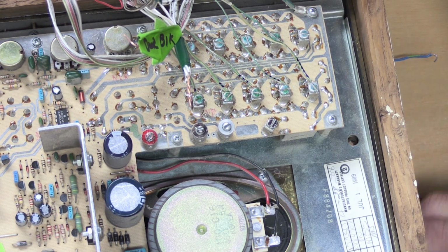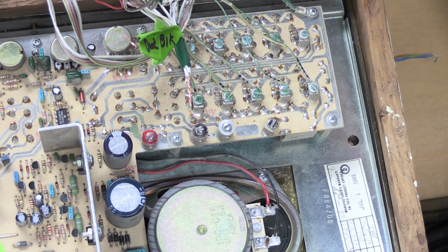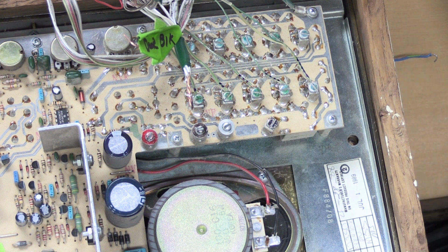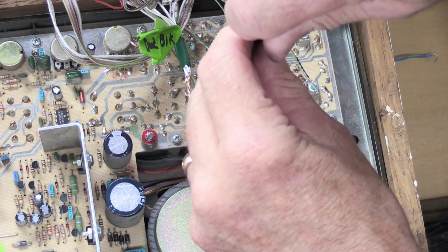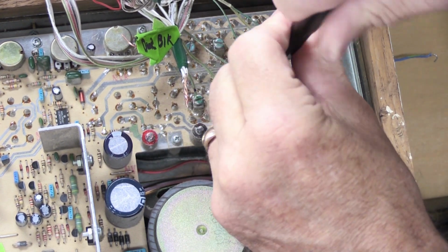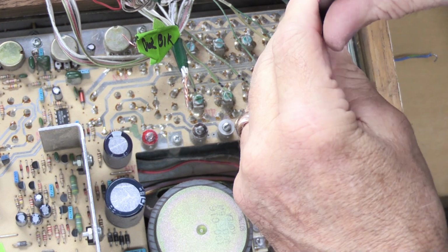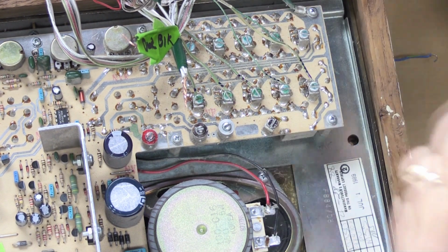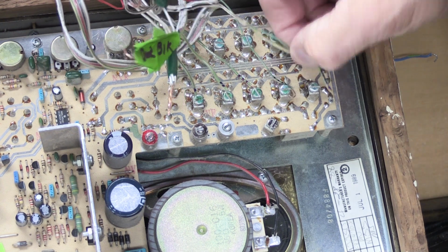Now, we've labeled the wires, we don't have a big wad of masking tape inside the wall, and we know which one is which. The Sharpies dry really fast, so that's not a problem. And while they're drying just a little bit, we can loosen the screws. Like that. And now we can disconnect the wires.